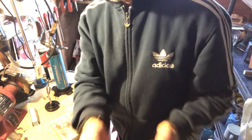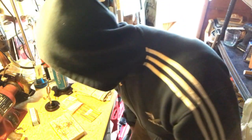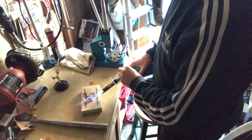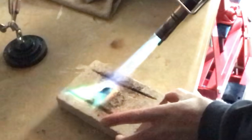I'll be using that mandrel to put the ring on and try and get it back into some sort of shape. That's the main bits I'll be using — fingers crossed we'll get it done. Right then, let's crack on. First off, going to anneal the ring. Turn that light off — only want a light pinkish glow. There you go, keep moving that heat, don't concentrate in one place.